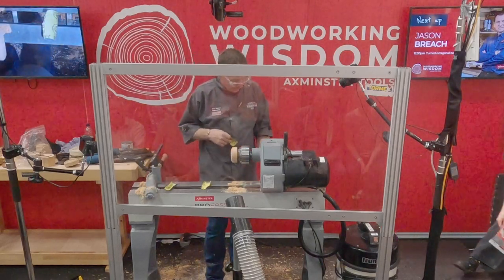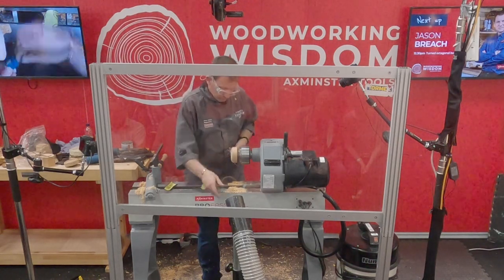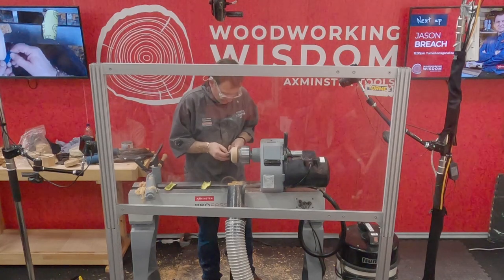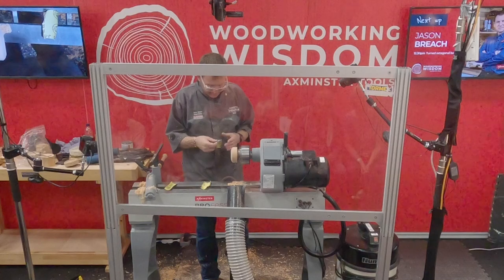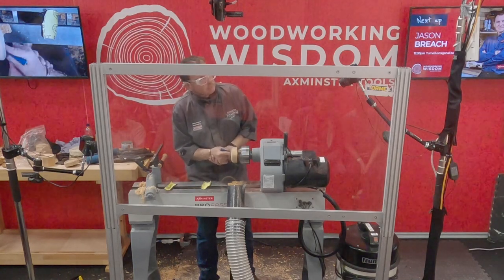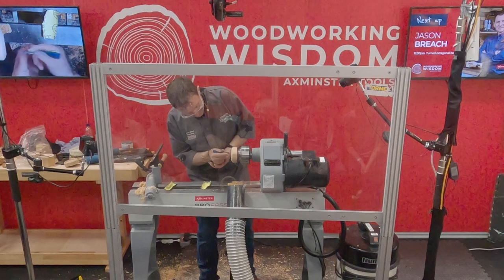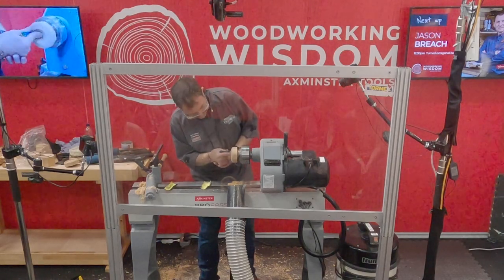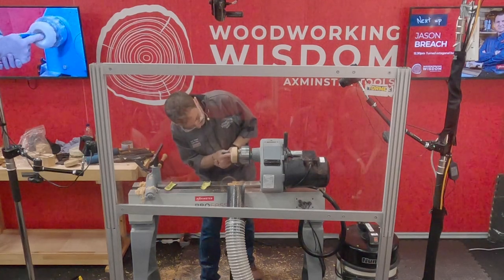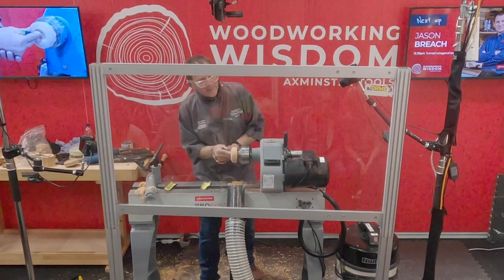At 150 grit, taking the banjo out of the way, keeping the speed high — I want to do that curve. If we keep the speed nice and high we don't soften the octagonal bits we've cut out. Then we take the speed down to about 700 — we can fold the abrasive and work the inside. Slower speed means you won't generate as much heat. Lots of little end grain white cracks if you're sanding are heat shakes — so take the speed down, maybe go back a coarser grade.